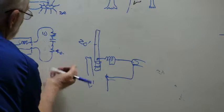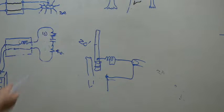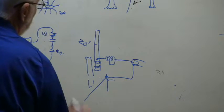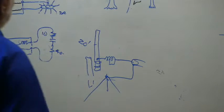So what that guy's doing is pumping 100 watts into this thing. 20 watts is being radiated and 80 watts is warming the worms. He has about 20% efficiency on this thing. Look what happens when he starts adding radials. He told me he would add one, and then the SWR started to go up. He'd add a second, and the SWR went up.